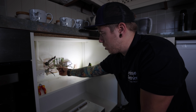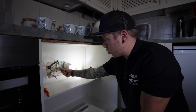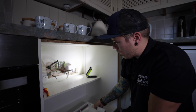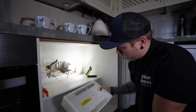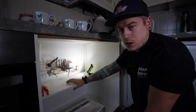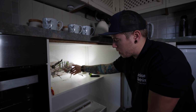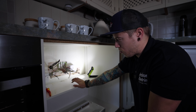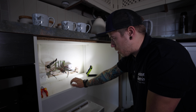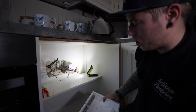So really, it's only these circuits coming down the capping that's going to be the old ones. And depending where I put the board, I should be able to cut some of this capping a bit higher, and that's going to give me some more length on these old ones. There's nothing worse than trying to struggle with a tiny bit of cable in the board, and I don't really like to extend cables if I don't have to. So before you install it, just have a little suss out in your head what you want to do.